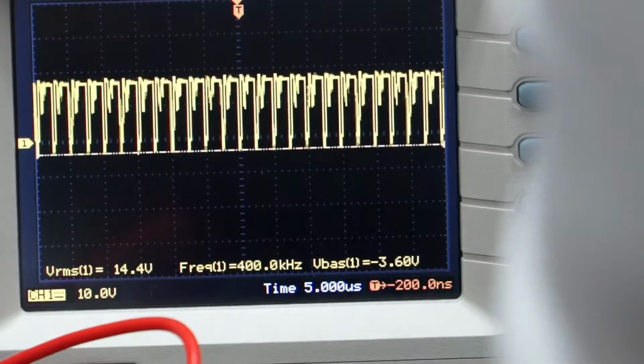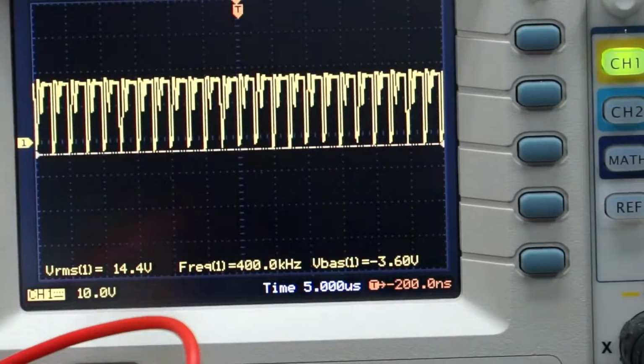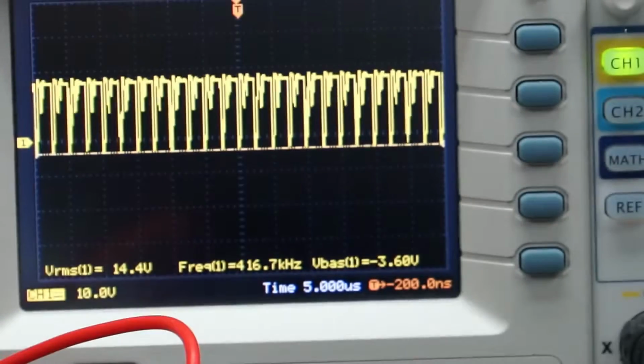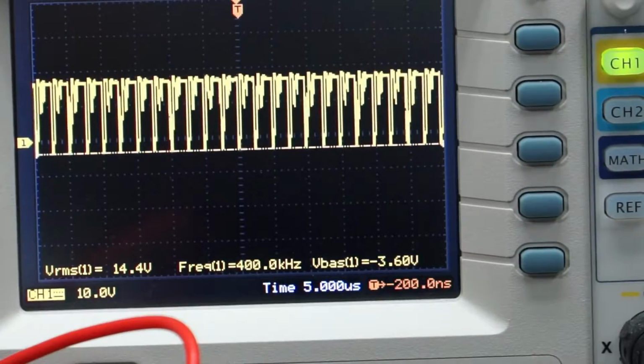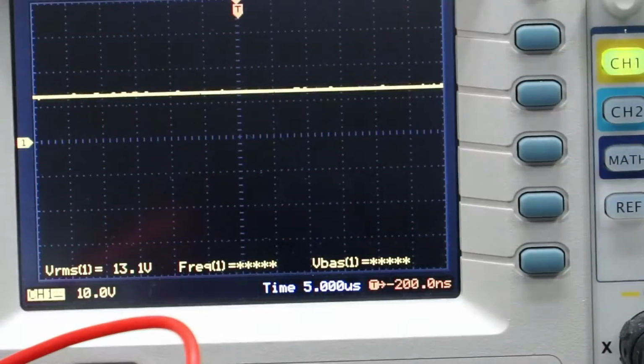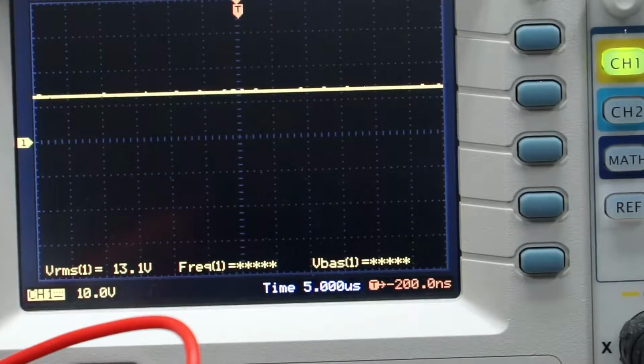And what happens is the inductor can only pass DC. It can't pass AC. This here is actually, believe it or not, some kind of looking AC. So look, it's going up, down, up, down, up, down. The inductor can't do that. The inductor can only do straight. So this is before the inductor. After the inductor, you have something that looks like this. It's straight, but it's a lower voltage.